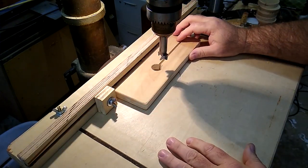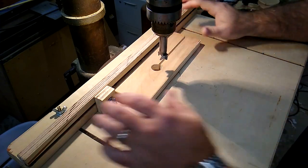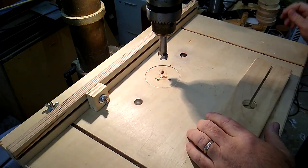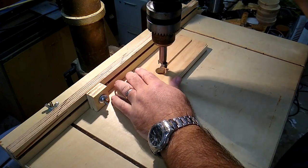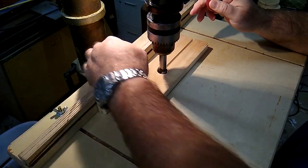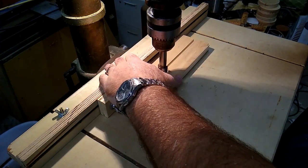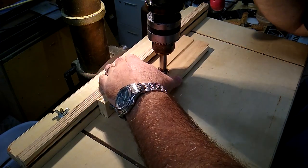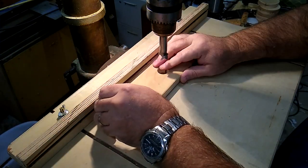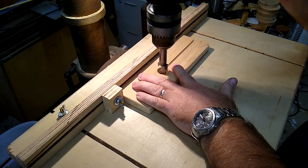That's the first part of this jig, and like I said it's a two-way jig — we'll be able to use it for something else too. I just wanted to show real quick how to realign this jig: you put the drill bit you originally used to drill the hole — in my case the seven-eighths Forstner bit — back in and run it into the hole of the jig, then align your fence and stop up to the jig. That will get you re-centered so you can drill more holes through cork after you've adjusted your fence.